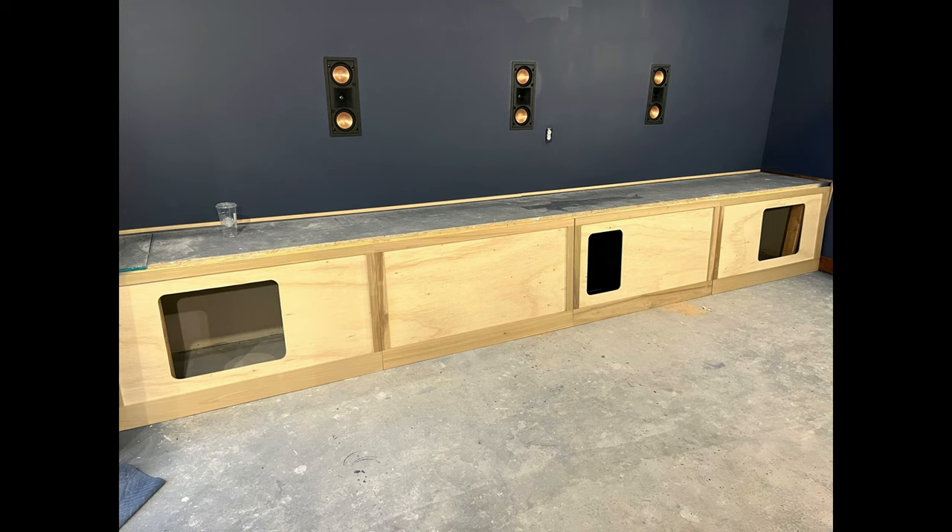As you can see, we've framed the stage with standard two-by-fours and three-quarter-inch top plywood. It's 26 inches deep and 24 inches tall. There's an opening for the Klipsch RP-1400 subs, and on the center right we have an opening for the equipment rack that slides in — it's a Strong rolling rack from Strong's company, which we use quite a bit, along with Middle Atlantic. There's also an opening that's acoustically transparent for ventilation and for infrared pass-through for devices that still use infrared remotes.